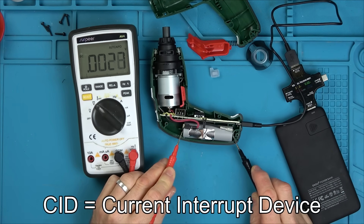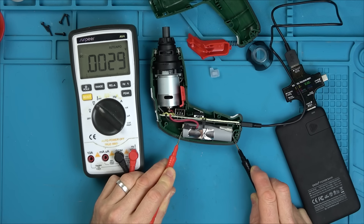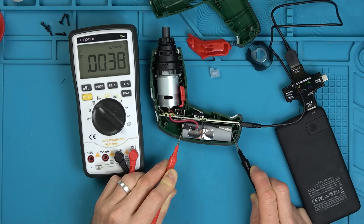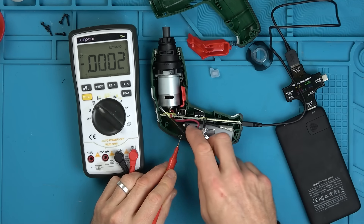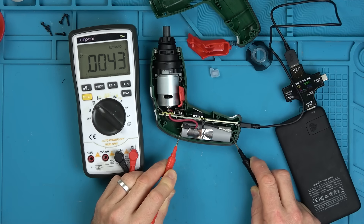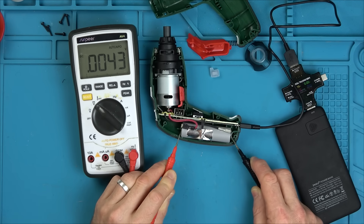I wonder has the CID gone on it. It went to 29. It is actually charging, but why are you so low? I think if I was to leave that — it takes three hours to charge — I bet after about an hour it would indicate a charge, because this should be a 3.7 volt battery, about 4.2 when fully charged. Maybe it won't even indicate charging until it gets to about 3.3 volts. Most people would plug that in, leave it for 10 minutes and say it's not working. But look, it is actually doing something — and that's why it's useful if you have a multimeter.